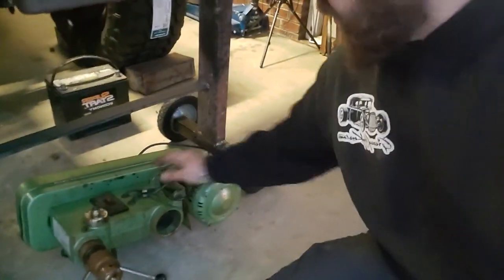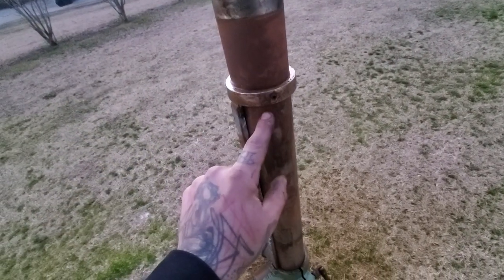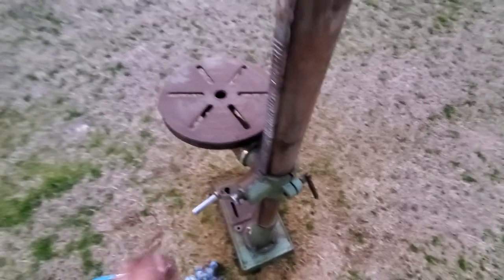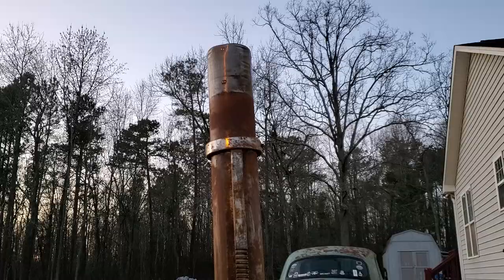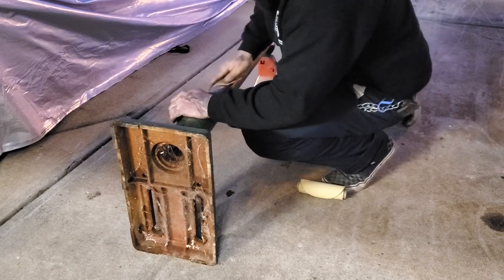I do have my dumb moments and this was one of them — this thing actually comes off. There's just two set screws on here and it slides right off the pole, so we're going to tear the pole apart and clean these parts individually. Same thing with the pole: you just have a lock ring at the top, take the set screw loose, take the brass hammer and knock that off, then pull out the gear track and the middle base platform. We'll take it apart the rest of the way, clean it up — and she turned out pretty nice! Nice and smooth. There were a couple spots we couldn't get out, but it's okay because it doesn't move right there. We'll go ahead and get this base painted up and get this pole oiled up so it doesn't rust.